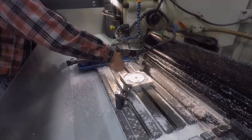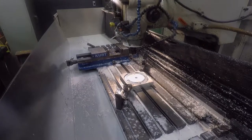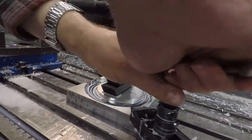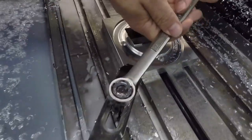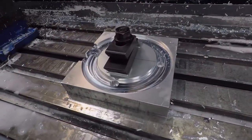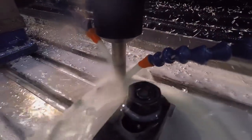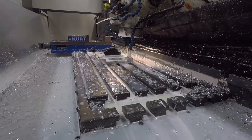With the inner dimension cut, it was time to inspect the progress and get ready to cut the outside dimensions of the adapter. This meant re-clamping the part to the mill bed. A bolt placed through the center hole was used to clamp the material. Once tightened, the part was properly secured, allowing the two clamps to be removed and revealing the outside diameter of the adapter for the next cutting operations. The roughing mill cutting tool was again mounted into the drive spindle, and material was then removed from the outer portion of the part through several passes. Bruce continued to monitor the progress of the cutting operation.